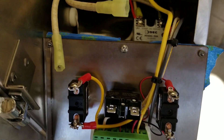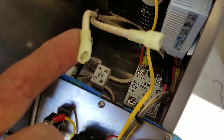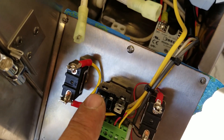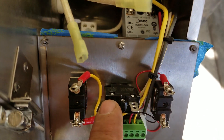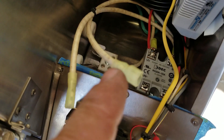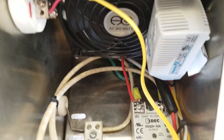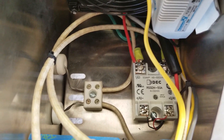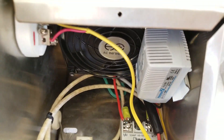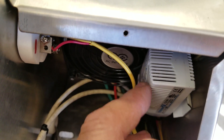All you have to unplug are these two power wires — they go through a thermal overload switch in the cover. Right before you button it up, undo your screw, get ready to put it on, plug these two in, drop the cover on. It's pretty easy to work on. I just thought I'd show you around inside so you know what maintenance you can do — if you don't think the cooling fan's coming on often enough, you can turn that dial a little bit.